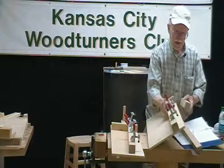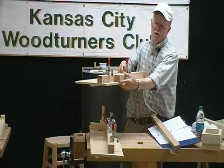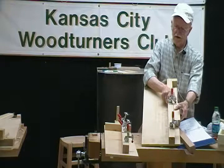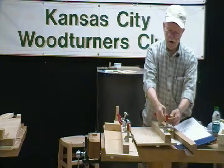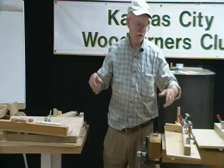What this jig does: if you put the piece in there, you see the overhang? It saws one eighth of an inch off. If I rotate it like this, it saws an eighth of an inch off again. If I rotate it once more, I've already cut an eighth of an inch off so it will not cut — you have to use shims. When you clamp it down, you put a shim in there to move it back over to cut the right amount. And you have to put a shim on top. In analyzing jigs, remember you have to know where you want the blade to cut to establish your fence.